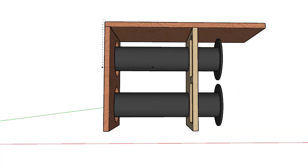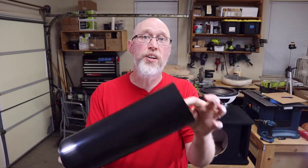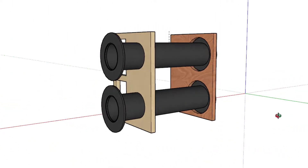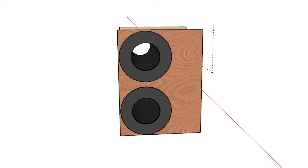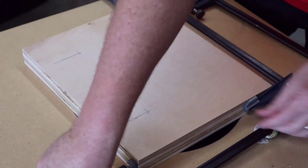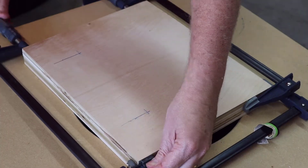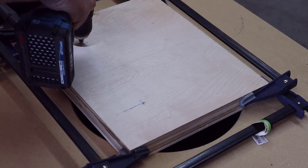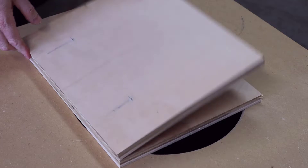The design calls for a brace and the port is going to have to pass through the brace, which is nice because then the brace can also support the port. That means you've got to make sure the holes on the outside of the box line up with the holes in the brace. Here's the trick: take one of the pieces, mark out the center holes for the ports, then take the two pieces and line them up together. Grab some clamps to hold the edges together to make sure the two pieces are perfectly square to one another — that point's going to be where I put the pin for my circle jig, so they'll be lined up together perfectly.